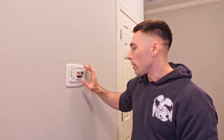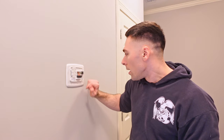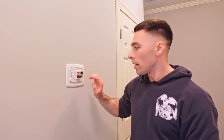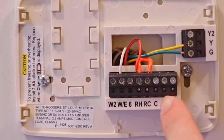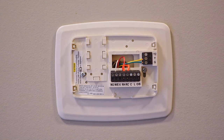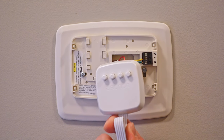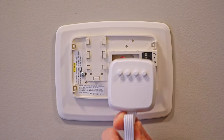Next, we're going to look at the actual wiring we have in here. We have a white wire, a green, a yellow, and one red. If you had multiple greens, that's also an issue. Our only problem here is that with only one red, I have to install a power extender kit upstairs in the furnace. My main issue is that I do not have a wire coming into the C terminal. If I had that, I could do a direct plug-and-play with the new Ecobee. So I need to go upstairs and take this Power Extender Kit that comes with the Ecobee and plug it into my furnace to make this system work.